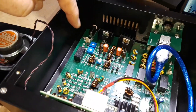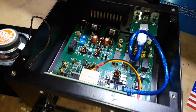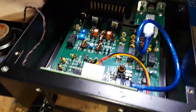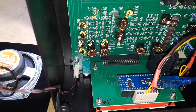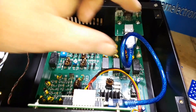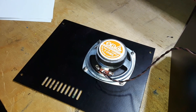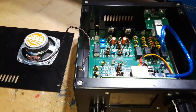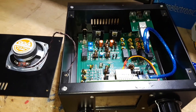The entire assembly really just consisted of: take off the front and back panels — four screws each — bolt down the main board with four screws, bolt the panels back on, insert what they call the Raduino (the accessory board with the Arduino) into the header going into the main board, screw it into the front of the case, add the connector, bolt the speaker into the top, and you're done. There is really no reason to do an assembly video for this.